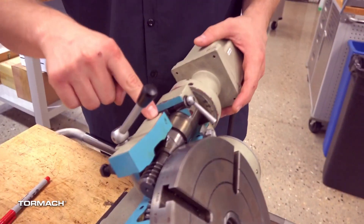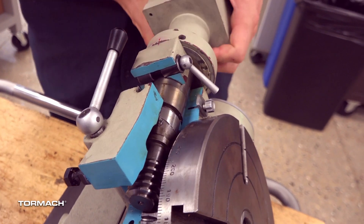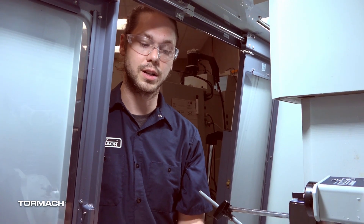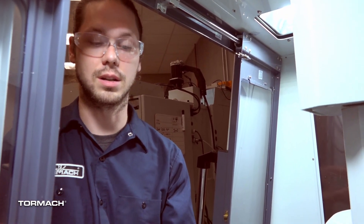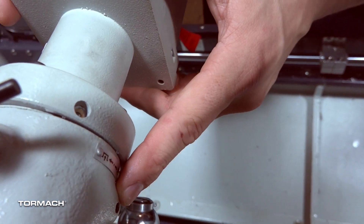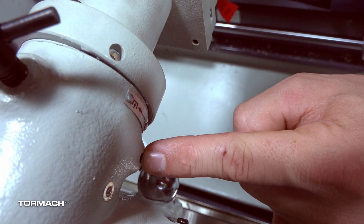There's a lock screw on the cam here that locks the rotation and will physically stop me from going any further. This is just the display piece to explain how it works, and later I'll show you how to check it with an indicator. So here we are at the machine tool. We're going to check our backlash on our fourth axis. Depending on your machine and your fourth axis unit, your set screw will be in a different orientation. We're working with the eight-inch super spacer right now. This set screw locks the paddle into place — you can see I can drive it and there's a set screw locking it from rotating further into the gear.